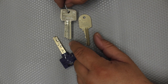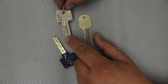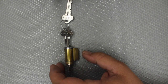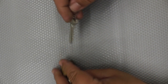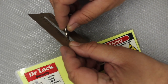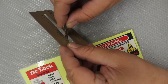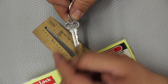Now, the question was — and that's just a bit of background — the question was: what do all those numbers mean? First, I want to tell you that sometimes numbers on the back of the key actually represent the direct combination for the lock. Here we have some Brava keys. The number on the back of this one is 3-1-4-5-1-3. Using my key gauge, going to the first depth I've got a three, second position a one, third position a four — so that's the actual combination.